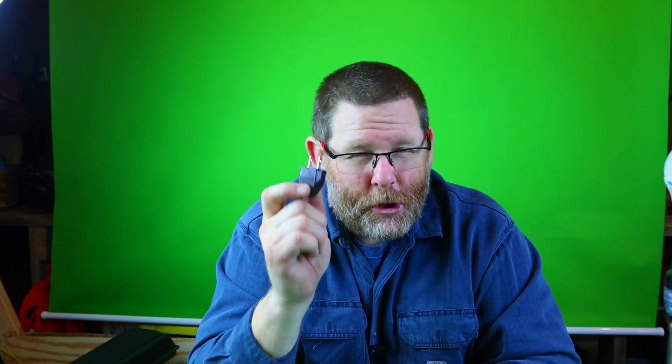I don't care if it was $10, it's a piece of junk because if you're plugging a lamp in and it's not polarized, it's not neutral specific. Polarized basically means one side is bigger than the other. So if you go to plug this in a plug and let's say this is the hot and this is your neutral, well now you've got the hot going straight through and somebody's going to be in some trouble — your kid, your grandma, or whatever. So it's very important to spend a little bit more money and get the polarized plugs.